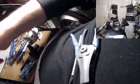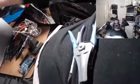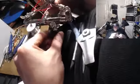All right, that was a good joint. My issue was just too much old solder on here. I should wipe it off and put fresh solder on it for each joint, I think. It was really crusty solder stuff that was messing me up. Okay. But we got it. Yeah, that's good.